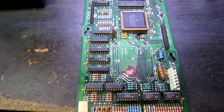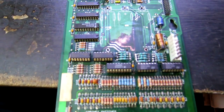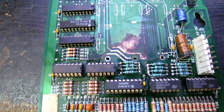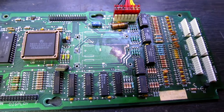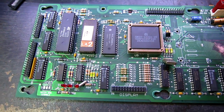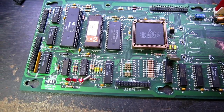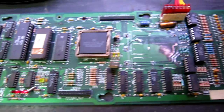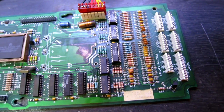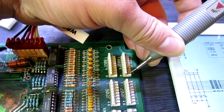Let's see if the game boots up. If it boots up we can proceed to test the functionality here, which is mainly the switch matrix - make sure there's no damage, maybe some broken tracks from all the corrosion. We're hooked up to power on the bench, let's fire it up. There we go - it's booted and running. Next thing to do is check these signals on the inputs and make sure they look sensible.